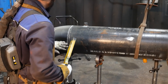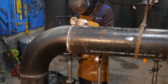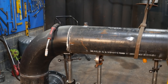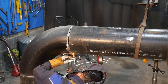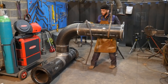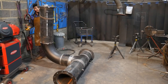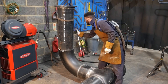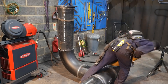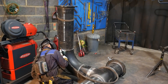I'm feeling up the pipe right now to make sure the outside of the pipe is aligned, which means the inside is aligned, making it easier to root. Once I know the bolt holes and the face of the flanges are level and plumb to each other, I can move on to tacking. I put my first tacks on the top, and the V-stand underneath is more on the elbow rather than sitting half and half on the elbow and pipe, so I can root the bottom of the pipe without having to move any V-stand.